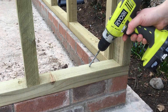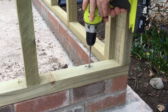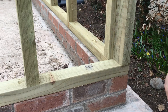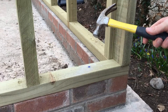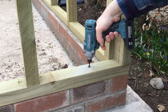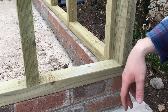To get my fixings in, I've drilled a pilot hole with a small drill bit and then I'm going to go through with the masonry bit. I'll change it to hammer setting and then tap in a rawlplug, and use my screw to knock it through the timber until I can feel it's hit the brickwork, then just tighten it up. These are 80mm screws I'm using — I think they're big enough, though I'm not sure if I should be using anything more substantial to go into the brickwork, but I think it'll be alright.